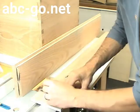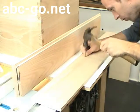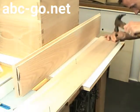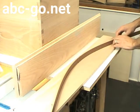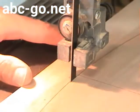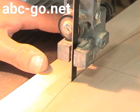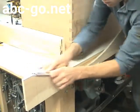Adding biscuits to this miter joint not only increases its strength but aids in alignment during glue up. Now it's time to make the arches in the base pieces using a technique called pattern routing. I make a full-size pattern on half-inch plywood by bending a flexible strip and drawing a curve, then cut it out on the bandsaw, staying as close to the line as possible. After it's cut, I fair the curve using a flexible sanding strip.